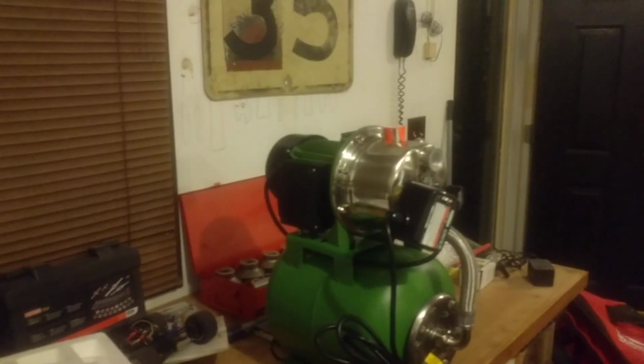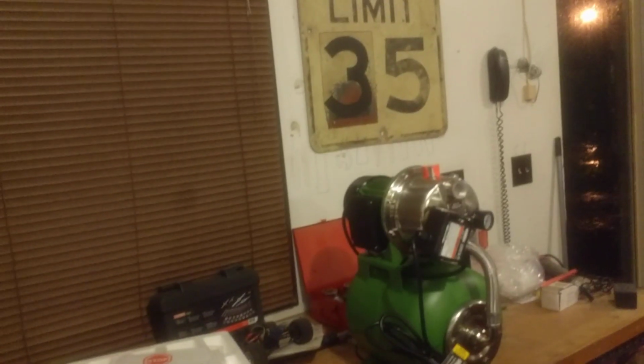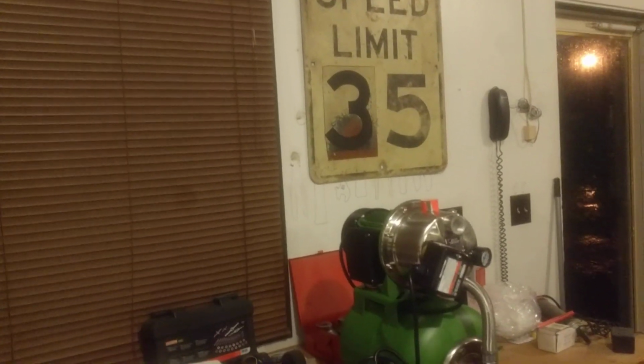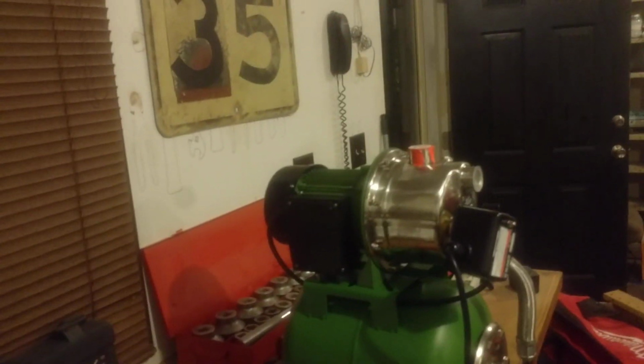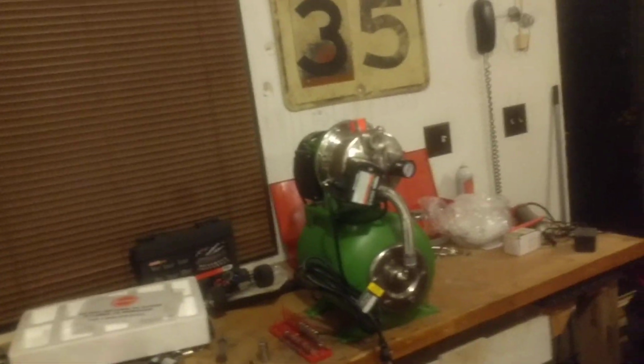It's in the summer, and so the pump will run for a few minutes, and then the breaker, it has like a big hand breaker in there, will trip on the pump. So it's either an aging pump, or it could be the well has a really low recovery rate. And it could be all the sediment builds up there as it really draws the water down, and the pump draws too many amps and it trips that breaker. So anyway, I'm not 100% sure on what that issue is.